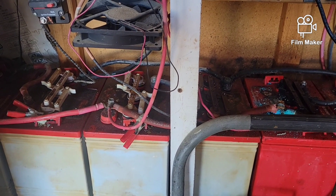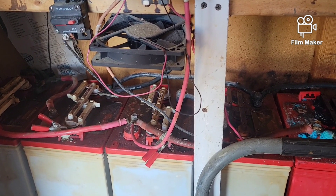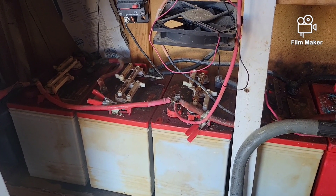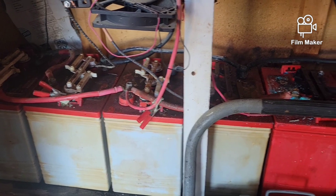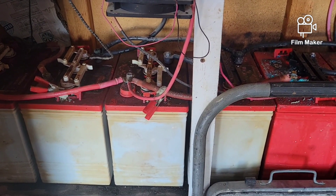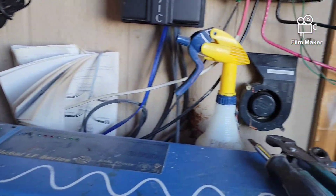It's time to upgrade, and I'm going to 48 volts — not 24, I'm going to double it. The systems are getting better and better. I'm not going to buy a bunch of 12-volt lithium batteries either — I'm going to buy 48-volt lithium batteries. If one battery goes out, it's one battery, not four 12-volt batteries that are gone. With lithium, even if one battery fails you have to pull the others too since they won't make 48 volts anymore — it takes four 12-volt batteries to make 48 volts.